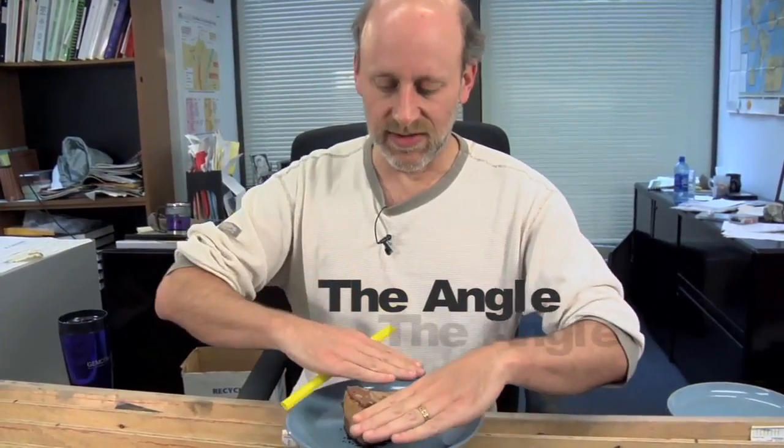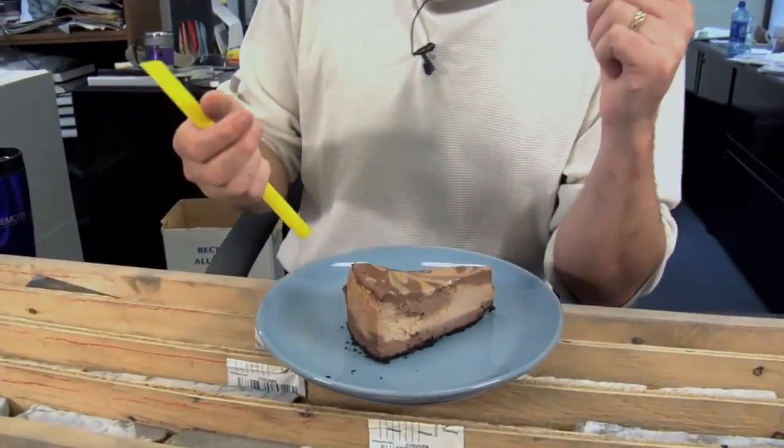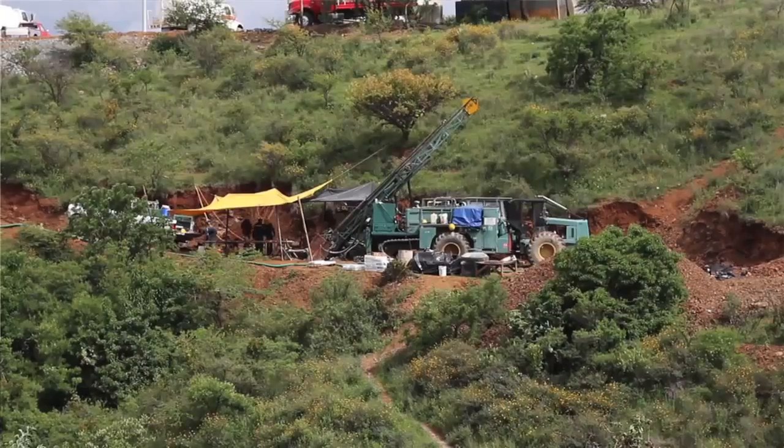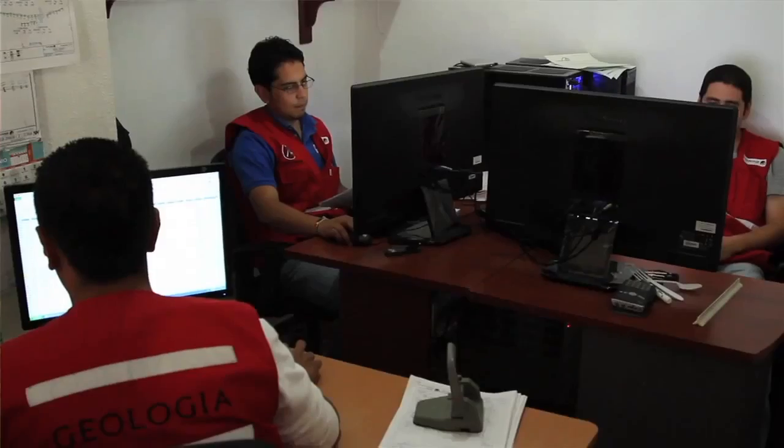Which way do I drill? All we know is we have the surface of the earth. We've done some mapping, we've done some sampling. Say I'm interested in the dark chocolate here — that's our prospective geology. We always have a target, and what we're drilling for are veins. The veins are dipping at a certain angle in the earth, so optimally you're trying to drill through this body at right angles to get a true thickness of it. We use professional surveyors who will angle the drill. From the surface you can generally go up to about 45 degrees. You're trying to build a three-dimensional picture of what that vein is doing inside the earth.